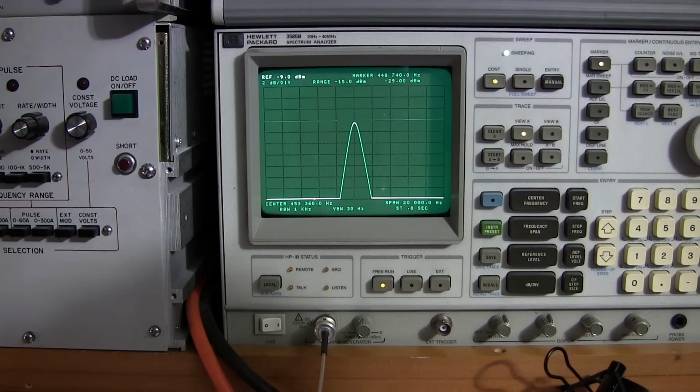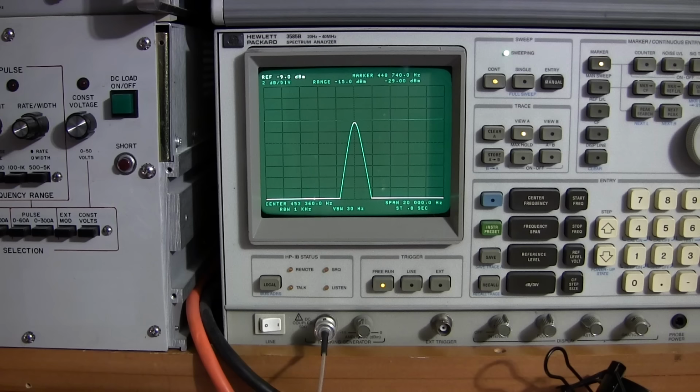So again, for all you guys that want to try and align one of these receivers, whether it be this one, the HQ-129X, the 120, any of these receivers that require this particular type of alignment, if you don't do it visually, you're going to have a very, very difficult time achieving what you see on the screen here. Again, we're talking hours of me tuning this to make everything even on the screen. It might sound okay, but when it really comes down to pulling those signals out of the mud or getting the maximum performance out of this receiver, it absolutely has to be tuned with some form of a visual means, whether it's a wobulator sweep setup or what you see on the screen here.